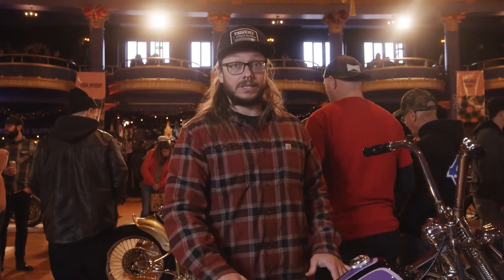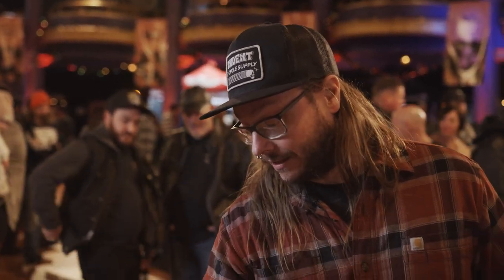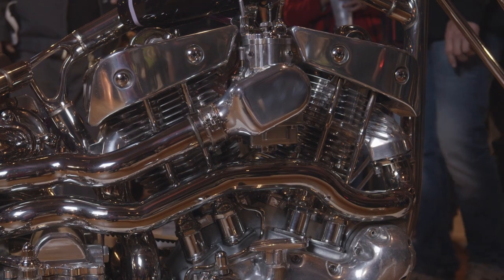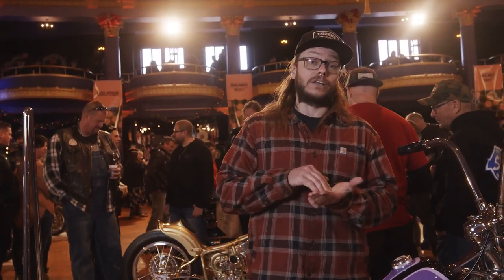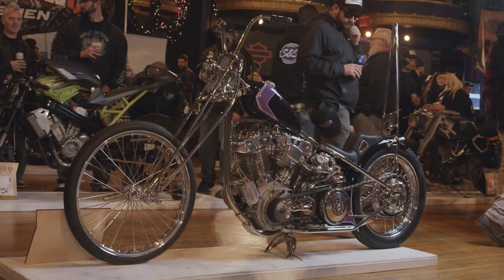The rocker pivots themselves are fully lubricated and it's not total loss. There's a feed that comes up through the cylinder, the oil flows down the length of the rocker, and then drains through the normal cylinder drains onto the piston skirts, so it'll run for a long time. The tappet-to-valve interface — both of those are above 65C Rockwell, so they should be pretty wear resistant.